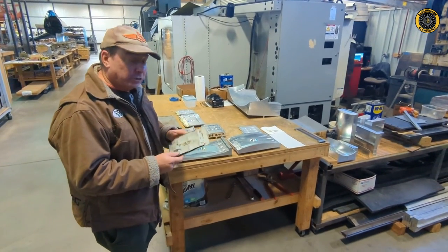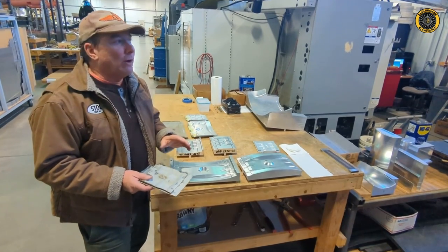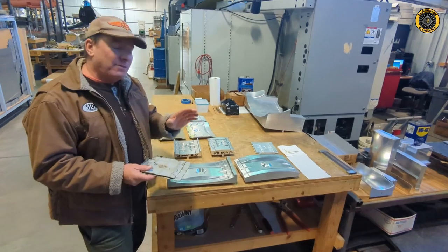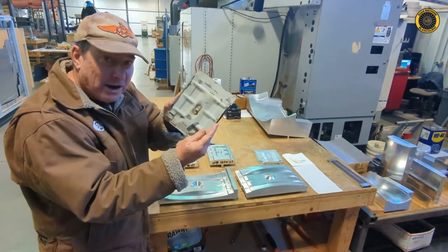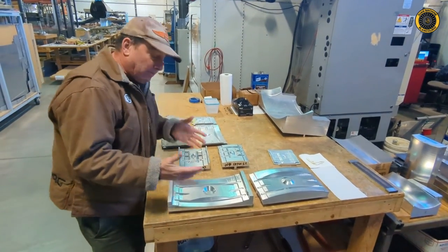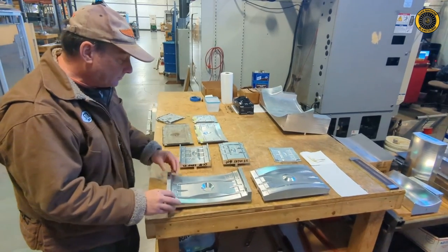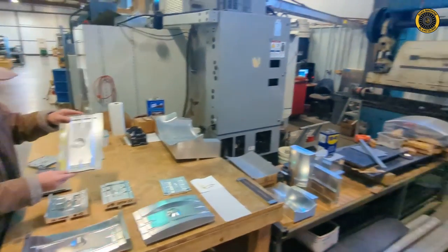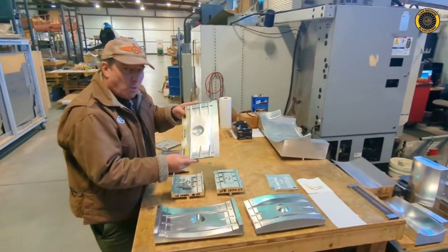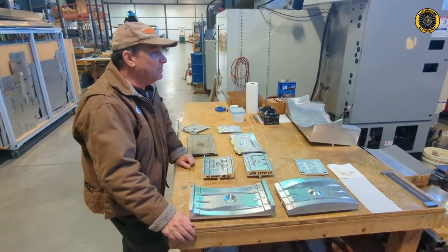So how do you recreate a Corsair from scratch? Well, first you start with the plans — you have to have acquired the plans many years ago before liability took away the ability to get the original plans. But even with original factory plans from World War II, those plans are just full of errors. So you start with the plans and then you start with an original part, backing up the plans with a real part to verify all the dimensions. Then you create the dies to stamp the parts out from those verified dimensions and start stamping out brand new parts in that 60-ton press. If you're going to go to all this effort, you might as well make dozens of Corsairs — enough parts to supply the entire Corsair inventory left in the world today.